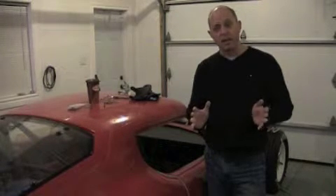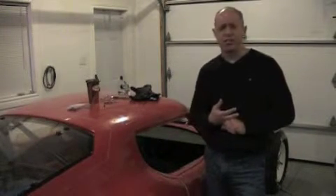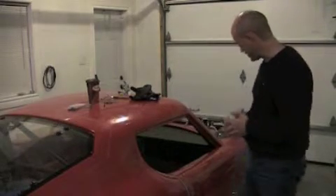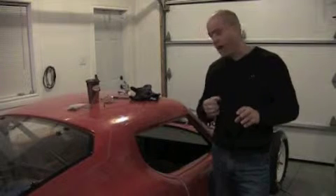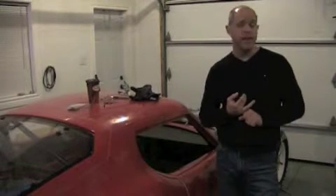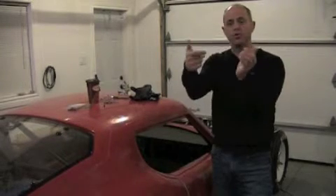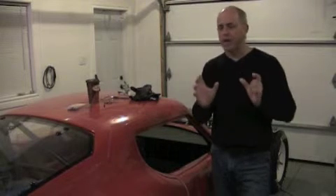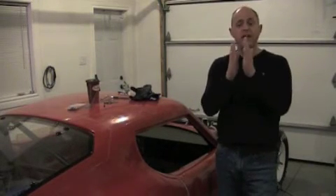Overall, I'm not guaranteeing it'll save you time, but a lot of folks online suggest doing the frame first then adding the skin later — which is what I did — and it took about an hour and wasn't terribly frustrating, just very messy from the fiberglass dust. Once the door is lined up and latching properly, with both the door and frame where you want them, the next step is to reach in behind the barriers and drill four holes through, then put a bolt through with a nut. If there's a gap between the door and frame — because they're supposed to be touching — add washers to fill the space.